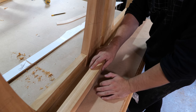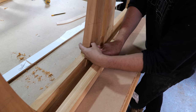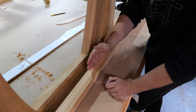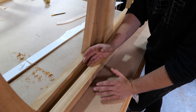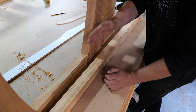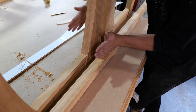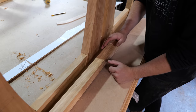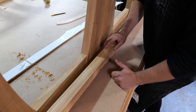And so when machining this, what I probably should have done is kept it at about 50 millimeters thick. This is 45 and this is now 45 as well. So by the time I cut that, it's probably going to end up as two halves of 20 mil, giving an overall thickness of 40 millimeters. And this being 45, there's going to be a weird step. So I'm going to cut that, plane the inside edges, and then once they're nested either side of this, I will then have a little bit in the middle to fill in with another material that I'll just glue in or something like that. Or if the gap looks good, I'll keep it.